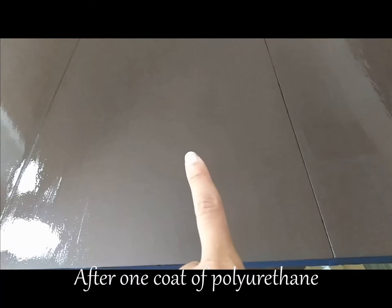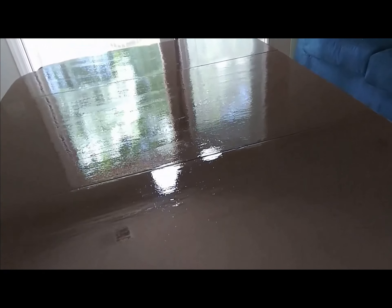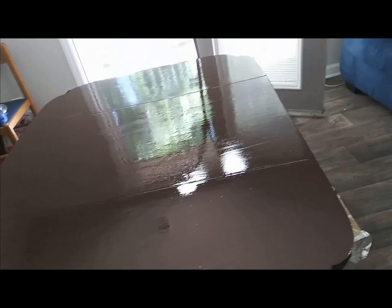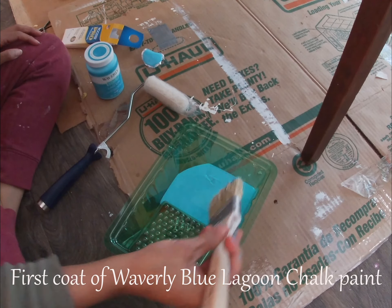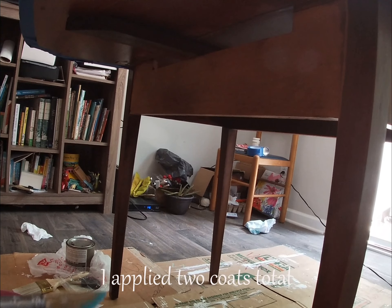The poly is now on. I used a foam brush in the middle and a regular bristle brush on the sides just to see the difference, but it also looks like a less even application, so at this point I'm just going to leave it alone. What I notice is that doing less is sometimes just better — just seeing what it's like, letting it go, and reworking it later if I need to.